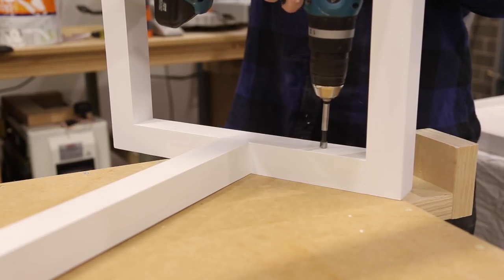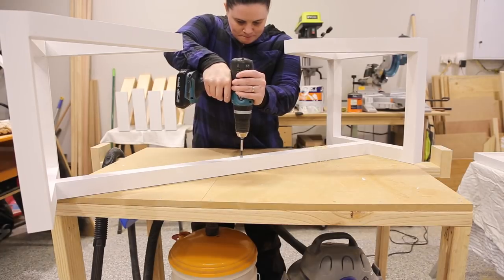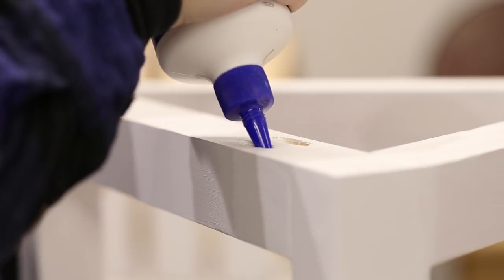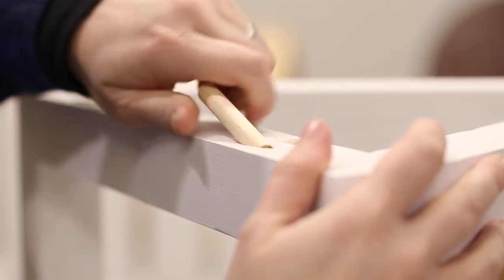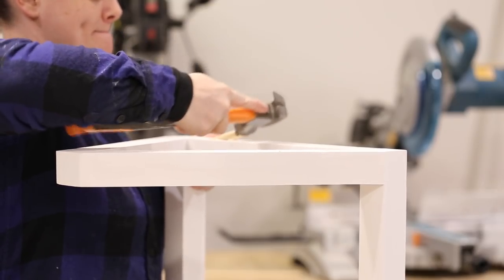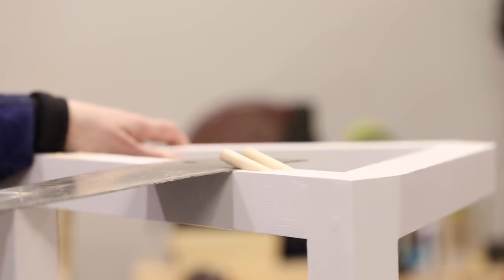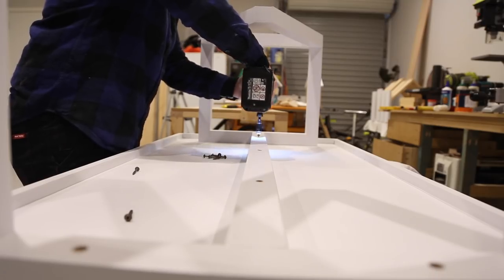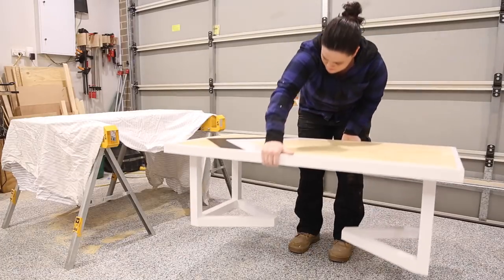With the tabletop drying I could drill the holes in the table legs which would be used to join the top to the bottom. I measured equal distance from each side and along the stretcher, then used a 3/8-inch Forstner bit and drilled to the depth of the bit to conceal the screws. There are many ways to plug pocket holes — Brad Rodriguez from Fix This Build That has a great video testing all the common methods, and I'll leave a link in the description. I used the dowel method: I rounded off one end of the dowel on the disc sander to help it go in easier, and once the glue dried I came back and flush cut them. It was now time to attach the base to the top — I made sure the base was centred to the tabletop and then screwed it down. Now I can flip it and check out my hard work.